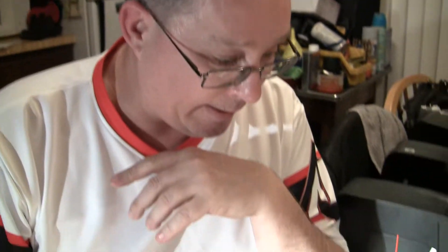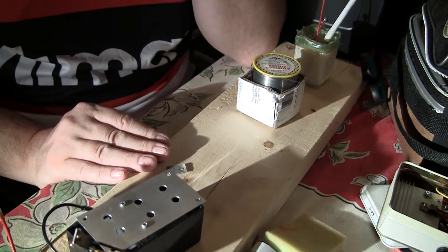We've upgraded to a new camcorder that runs on 9 volts instead of 5. I've got a 7809 voltage regulator — these cost about 13 cents — and that drops 12 volts down to 9. The interesting thing is: 12 down to 5 is a 7-volt drop, but 12 down to 9 is only a 3-volt drop, so it's less work for the regulator and less wasted energy as heat. Heat is wasted energy coming from the battery, and I'm not building a space heater — I'm building a battery pack.